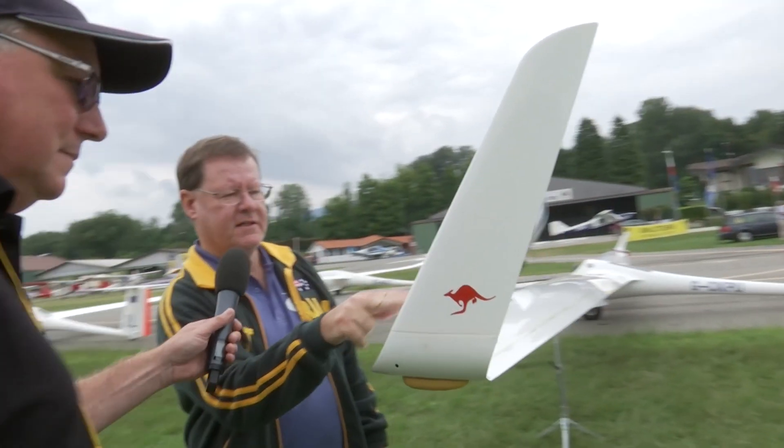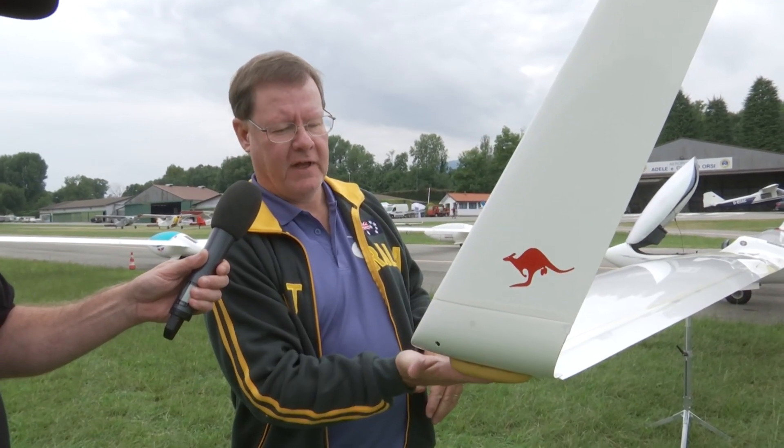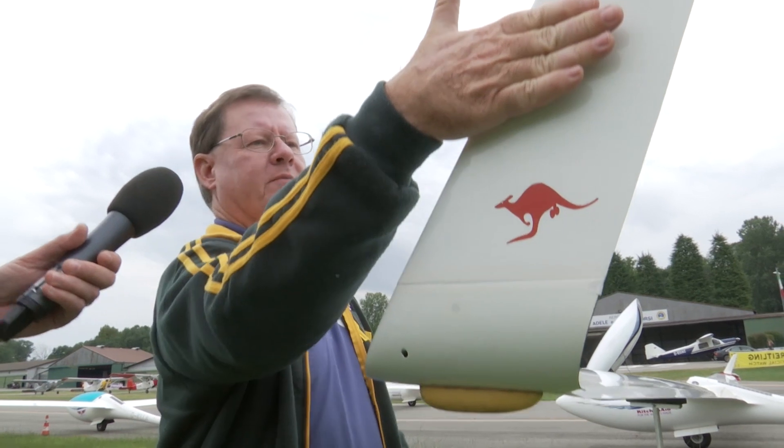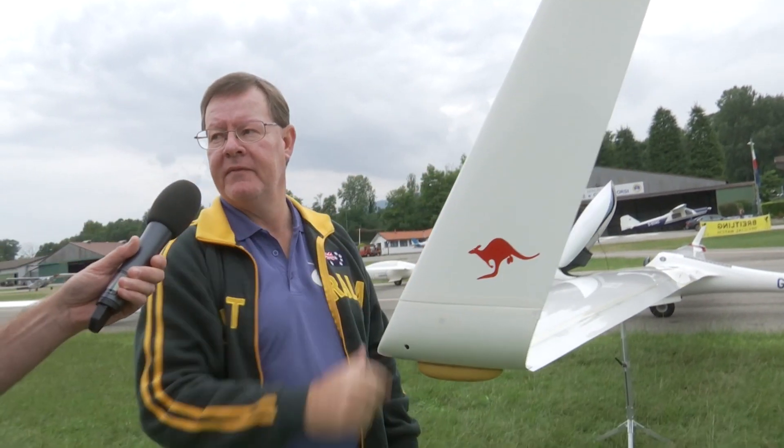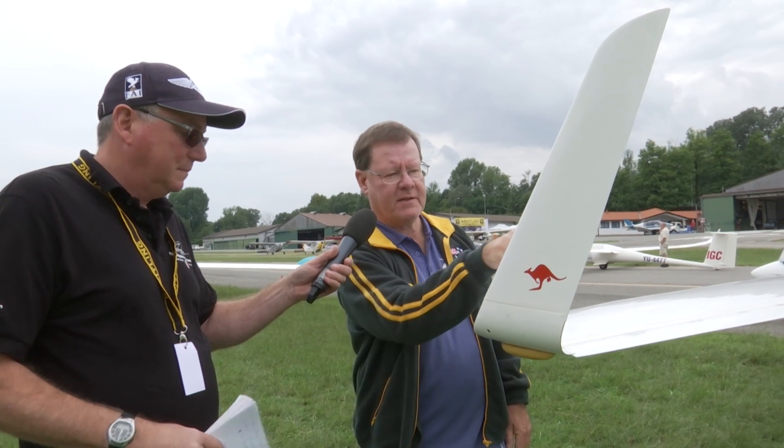It's got a flow up around the tip and then a very conventional wing tip. There's always an outward flow under the wing, and the air then pushes against the winglet and gives you a little bit more upward thrust and takes away some of the vortices.